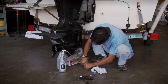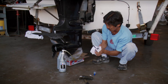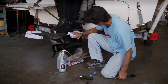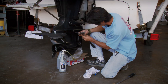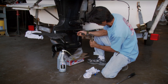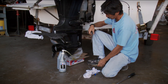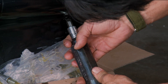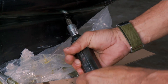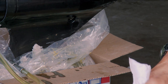These gear case plugs should have a torque value. You need to make it relatively tight — you figure that these things have ocean or water rushing past it. So I like to sit down and snug it up. Usually by this time my hands are pretty oily, so holding on to even a big screwdriver becomes difficult. This is nothing more than an impact screwdriver — helps make sure it's snug.